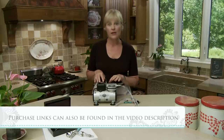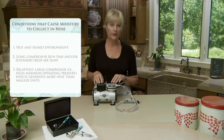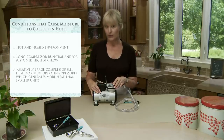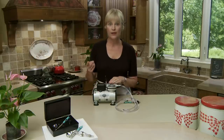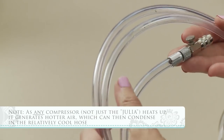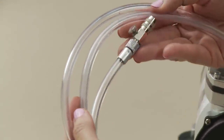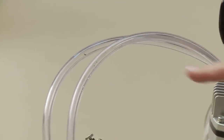This video is only going to be of use under a limited set of circumstances — those are if you are operating under super high humidity and heat conditions, or if you're operating your compressor at high output for long periods of time. In both of those cases, water can sometimes accumulate in the compressor line. I was operating this one today; it's over 100 degrees, 100% humidity here in St. Louis, and was also operating it pretty hard. You can see there's a moisture droplet here, some condensation here.